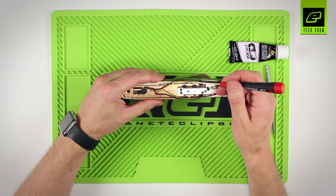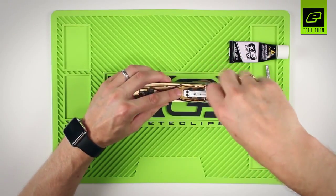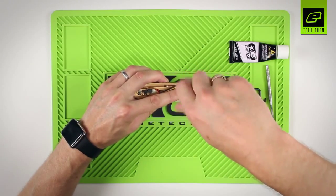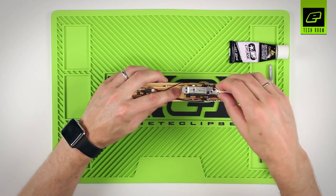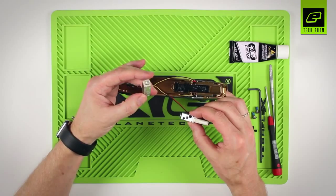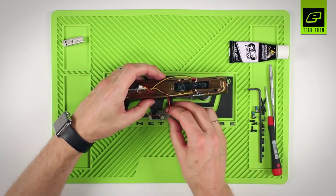With the wires moved away from the solenoid body, you can now remove the 4 mounting screws. And the solenoid assembly can be lifted away. Just disconnect the spool assembly, the main body, and place it to one side. You can just leave the mounting plate and the pilot to hang free at the side.